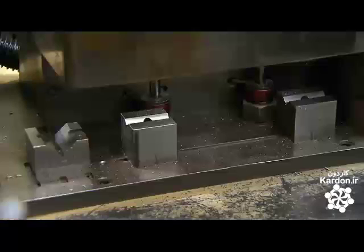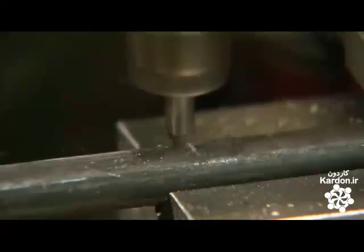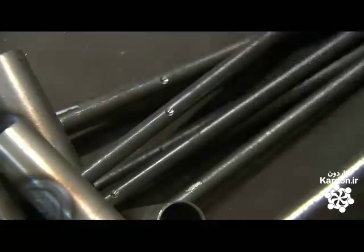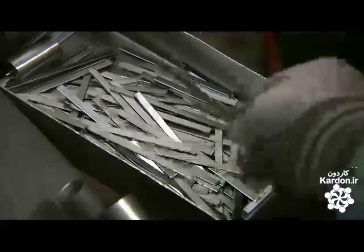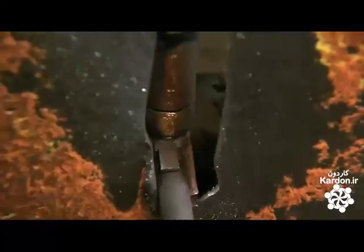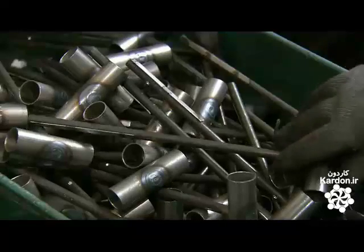A machine drills a set of small conical indents in the handle. Fitting a set of pins inside the mold, these indents will be crucial to the process. Because the internal handle is round, the urethane exterior could twist on it when the hammer is being used. To prevent this, the urethane will lock in place around the tab.